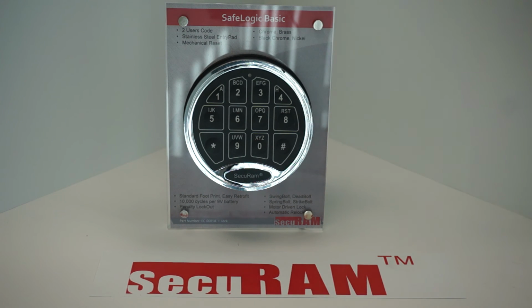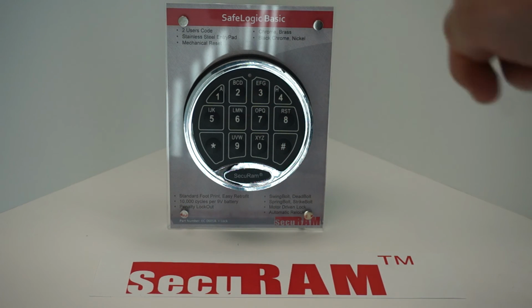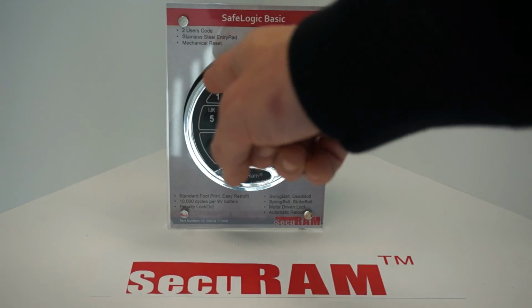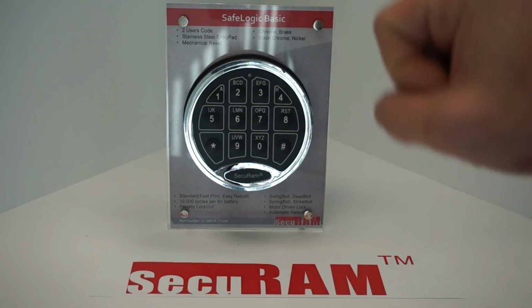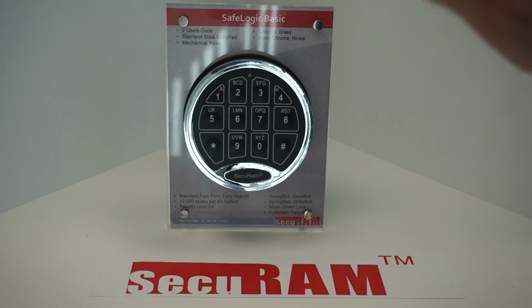The second thing you want to try is you want to definitely look at that 4-pin cable, because that's the lifeline. If that 4-pin cable itself is not inserted into the entry pad all the way, and it doesn't have a connection to the lock, even with the battery inserted onto the Entrypad, you will not be able to get any response out of it. So even though it's a working unit, without a lock attached, it won't respond to any button pushes or any indication that it's even working.